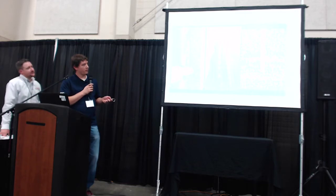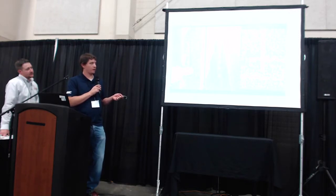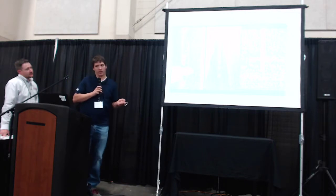Right here, this, I believe, was a 3-inch lift design. Where this crack is, the asphalt was probably 2.5 inches thick. That night before we left, you could see a crack there, but overnight as it sat, that crack developed. This production day was actually in reject. I can't remember if it was for gradation or binder content. So we ended up getting them to remove this area, but the contractor didn't even want to remove it after that. We had to fight him to get him to remove this. That was the big issue I have with the spec.